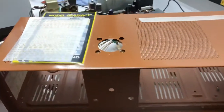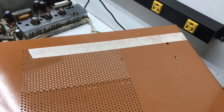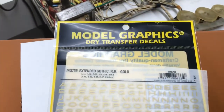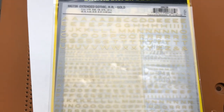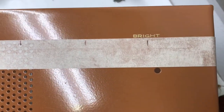The cabinet is painted and I've got it up here in the basement shop. The decals for the controls — I sanded them off, so I'm attempting to put them back. First time I've ever tried this. Here's what I'm using: it's called dry transfer decals. I can remember these from years ago. You just put the decal where you want it — in this case, a letter — and rub it until it becomes transparent on the paper and you've transferred it onto the surface. Here's what I've done so far, and I think it looks pretty darn good.